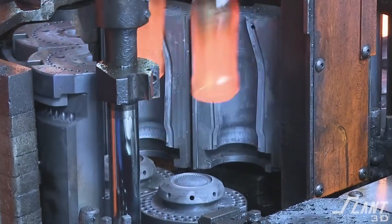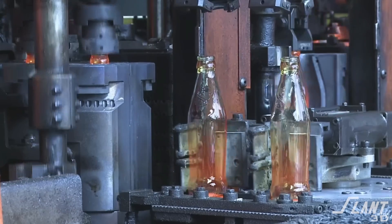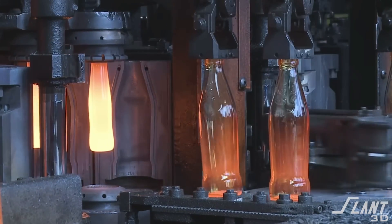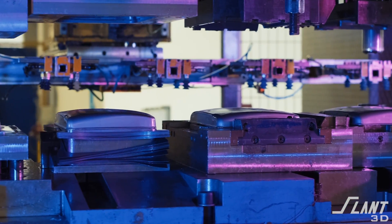If you were using glass, it would also probably be a blow mold — basically a tube with a blob of glass on the end that they shoot air into, which expands to fill the cavities of the mold and gives you the shape of the glass bottle. Metal is similar in that you would use a die or press mold, a compression mold — basically a large piston hits a sheet of metal and forms it into the shape of whatever the die is.